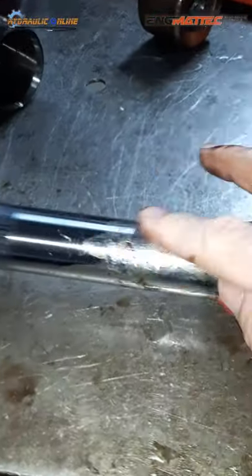Next. Okay, so tell me about the piston. We're moving to the piston. So what's special about this piston? This creates the movement of what you're pushing and pulling in your cylinder. On a cylinder, the oil can travel in both directions, but only one at a time. So when oil is pressurized through this port, it will push this piston in that direction. And this piston is attached to this rod? Yes, it's all one piece. It screws on like that. It's not screwing on because I need to clean the thread. Again, you've got pressure on here.